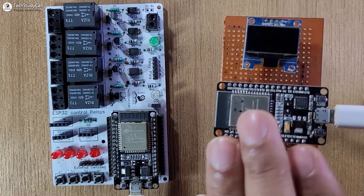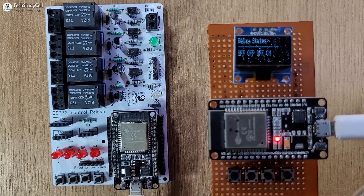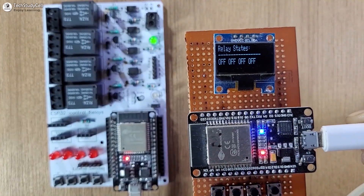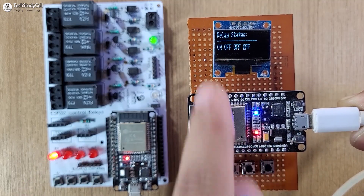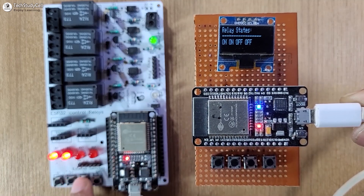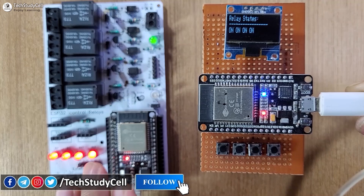After programming, here you can see the master ESP32 and the slave ESP32. Let me turn on the supply for the master — and since the slave is not connected yet, the blue LED automatically turns off. Now let me turn on the supply for the slave — as soon as the slave connects with the master, the blue LED turns on and we can monitor the real-time feedback on the OLED. Let me turn on the first relay — the relay turns on and we can monitor the feedback on the OLED. Now the second relay, the third relay using the push button on the slave circuit, and the fourth relay using the master circuit — all relays are working correctly.